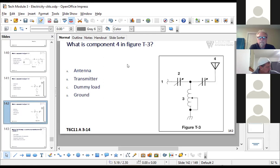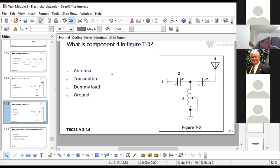Okay. Now, here's the funny thing. When I was 16 years old, according to FCC regulations, you're not supposed to test that much on the air. So it's good practice to put your transmitter or transceiver into a dummy load, which just takes the power, contains it, and doesn't let it radiate out. In the old days, we used 100-watt light bulbs that we'd hook up to the terminal of our transmitters. And you can see the light bulbs light up as you adjust the transmitter. And some people had made some long-distance contacts using those light bulbs. So they weren't very good at containing radio frequency power.